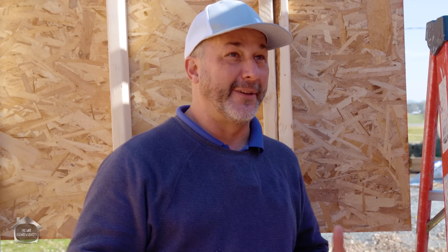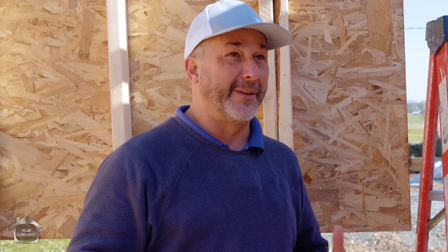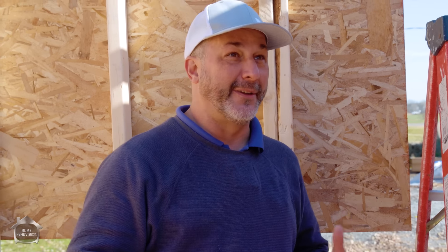The key here is water management — waterproofing the deck before we put the roofing shingles on, house wrap on the outside, sealing up and diverting everything with the trims and the siding. We used 5/8 tongue and groove sheathing on the roof. It's a low slope, so it's going to carry a lot of snow load in the wintertime. We used ice and water shield and an architectural shingle over top — we used the whole system from GAF. If you'd like to see how that's assembled, we did a great video on re-roofing the main house and all that information applies. Low slope — you've got to have a complete membrane on the roof and that's what we did.